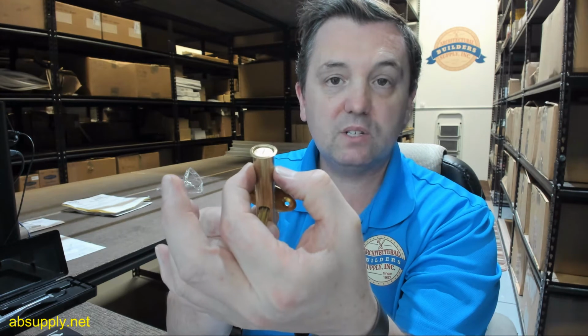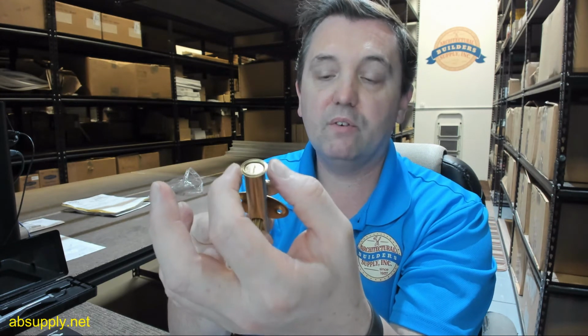0.55, so 9/16 is good, which is 0.5625. 0.705 is good out here. Okay. Well, so what they're saying is on the style of the door, 45 to 60 inch from the bottom of the door. Put it anywhere you want. 60 seems awfully high for a mortise door bolt. So does 45 inch. 9/16 hole, 2.5 inch deep. Let's test that and make sure that all makes sense.